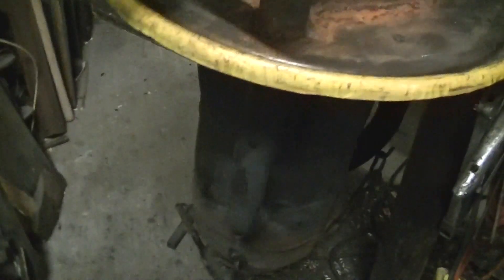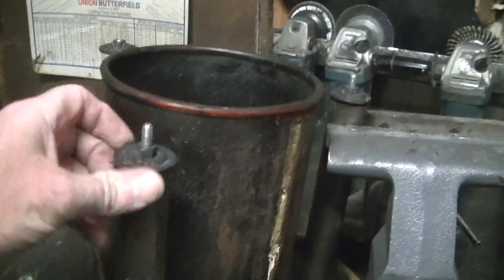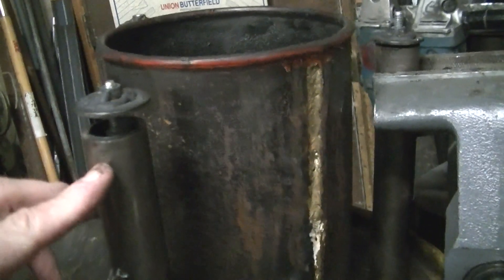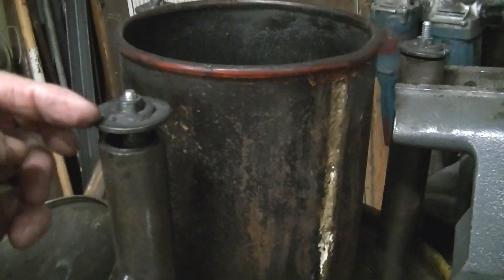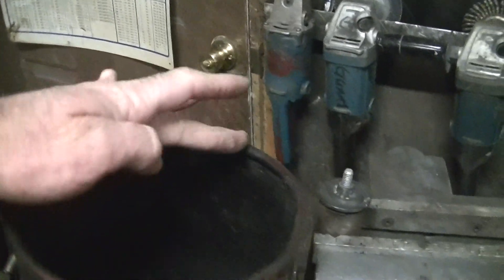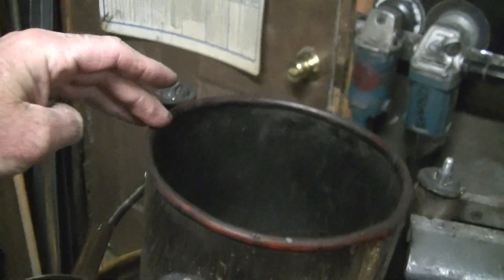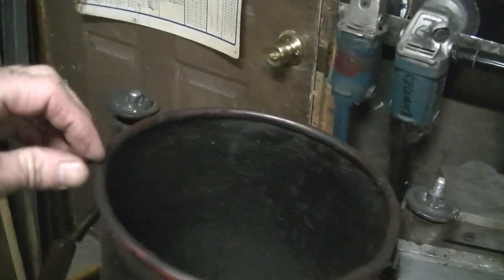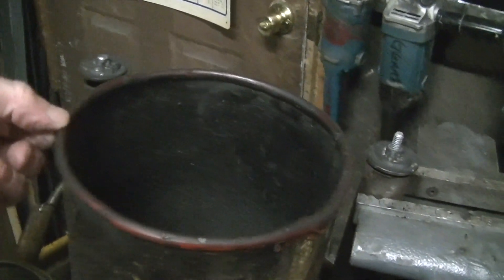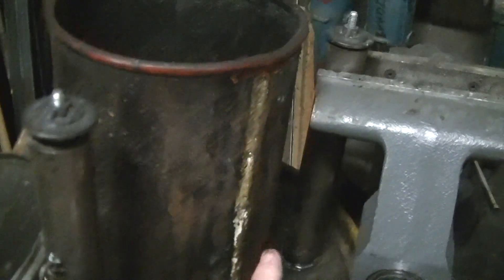For the shaker, I want to go around on top. On my air intake I've got some air adjustment — it's got a bolt welded down inside with flat washers so I can adjust that on all three of them. To seal the top, I got a piece of Tigon fuel line, split it down the center lengthways, filled it with red RTV silicone, and pressed it on there.